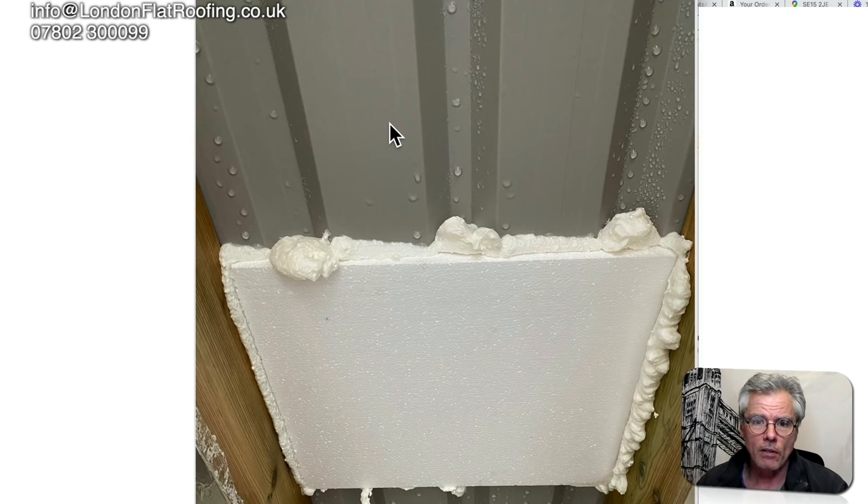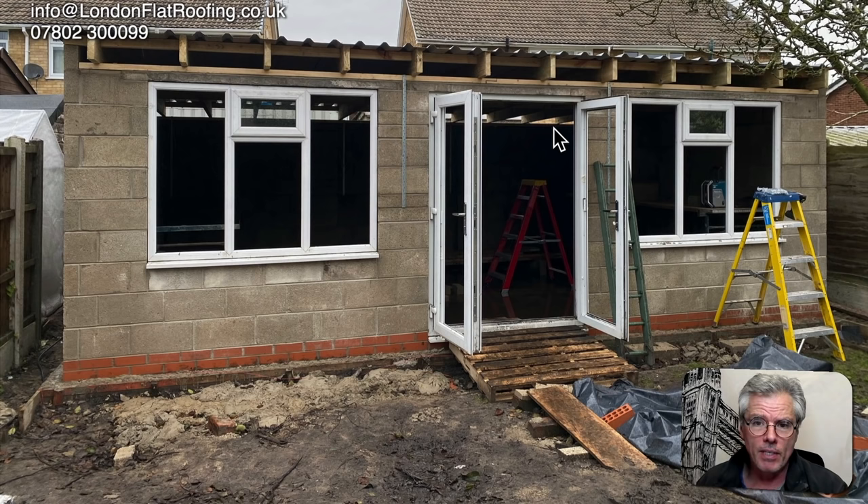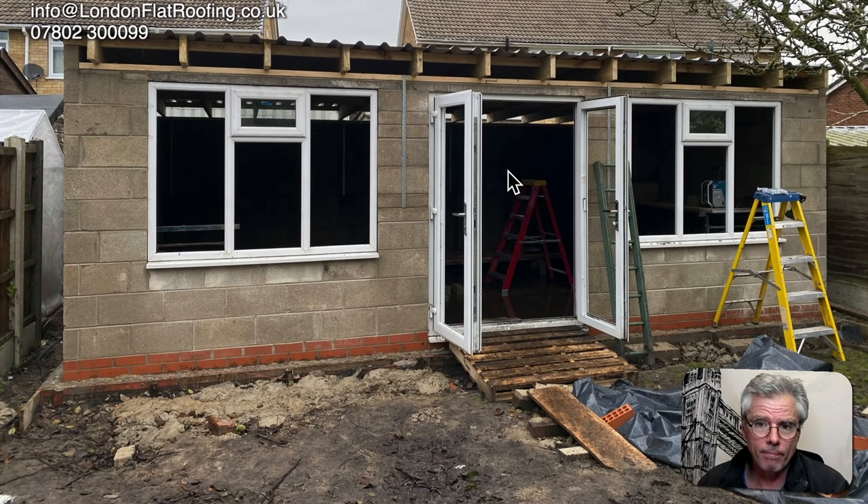Let's look at this all the way around. Look after the external environment — even the BS standards talk about making sure the overhangs of the roof and all around the outside are clear of foliage, and that you've got good movement of air around the outside, because all that air would be holding moisture which will go up through your venting. So look after that external environment. At this particular stage of building, try to keep your construction moisture down to a minimum and get rid of it as best you can. It's very difficult to do in winter, but there are ways — increasing ventilation, heating, and keeping the rain out as much as you can. Hopefully that helps.